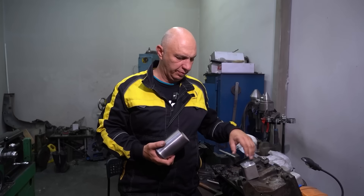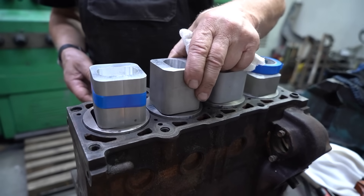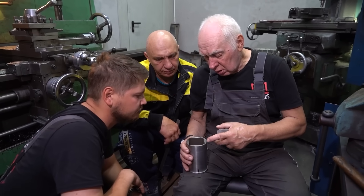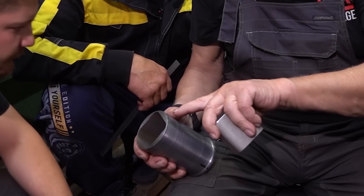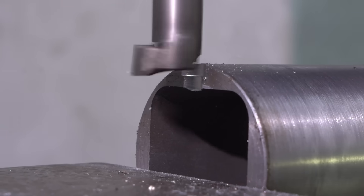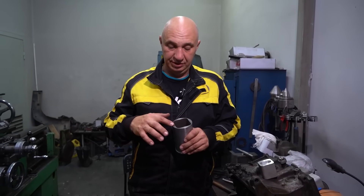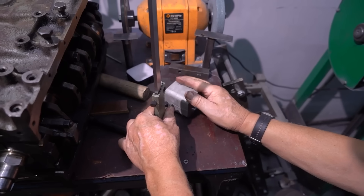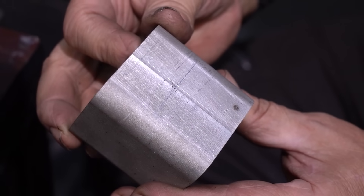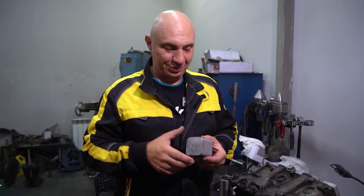This isn't a serious issue, but it is a setback. The height of the piston has changed, and as a result, when the con rod makes its way up, it actually comes into contact with the sleeve. But this can be resolved — we'll just make some recesses in the sleeves to allow the rod to move around freely. After sorting the cylinders, we will begin work on the pistons. These do require some modification; so far we've only made the bore for the rod and have yet to cut out the grooves for the piston rings, but we'll get to that.